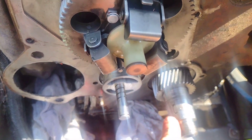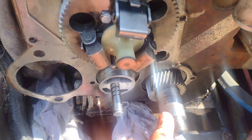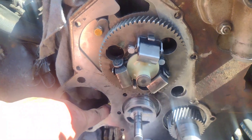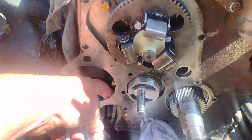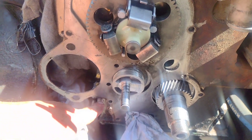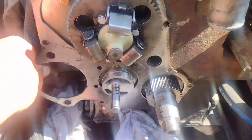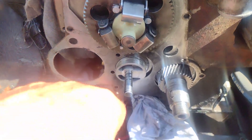This keyway was sheared on the crank. They had it close but somehow it was sheared — it was still running, still tight. But this plate was leaking all the time back in here. A few people have this problem — it leaks, drips motor oil, and you can't fix it. It's always dripping out of here and you go nuts keeping taking these covers on and off.